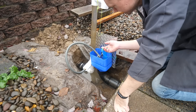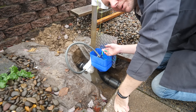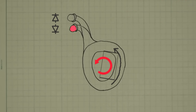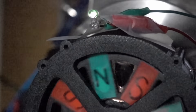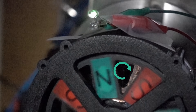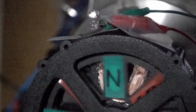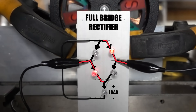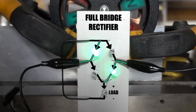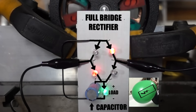It's basically stopped raining right now, so we're just dealing with the water that's in the pipe. I can go build a rectifier for this really quick and we'll just wait for it to start raining again. In one of my earlier videos, I explained these opposing LEDs blink because a magnet is sweeping across both sides of the same coil, driving current in opposite directions. Spinning the alternator with my lathe lets us watch the physics in real time. This shows why alternators produce alternating current that has to be rectified if you want direct current like a battery. Arranging the LEDs like the diodes of a rectifier, you can see how the load at the bottom lights up no matter the direction of current flow. To light the LED continuously, we add a capacitor — it acts like a balloon, storing and flattening out the peaks of electrical pressure for nice, steady direct current.